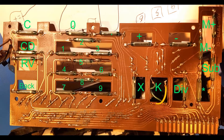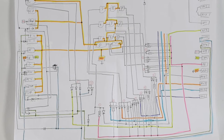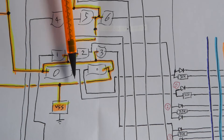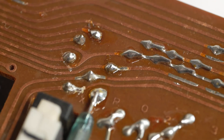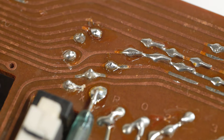This time I went to the effort of drawing out the keyboard circuit diagram, which took an absolute age. Once this was drawn up it was crystal clear that the fault was somewhere on line KF4. If we look at memory plus, it connects KF4 and KF2 to ground. And then look at zero — this key simply connects KF2 to ground. So if line KF4 is out of operation, memory plus will enter a zero, which is what it did, and this was confirmed looking at other faulty keys too. So I removed and checked the wire between the main board and the keyboard for KF4, then resoldered it back in place. I checked the tracks from that wire back to the chip, and then turned my attention to two vias on the keyboard PCB where the track swapped sides. This PCB doesn't have through-plated holes — instead they just solder a plug through the board — and although it looked fine, I suspect there was a dry joint, because since resoldering that I haven't had any more trouble.